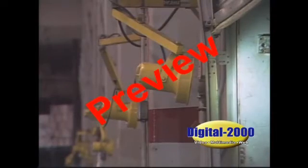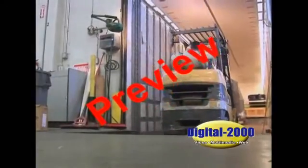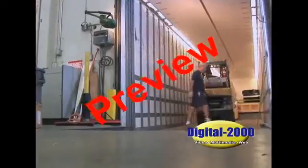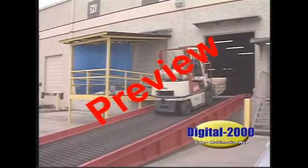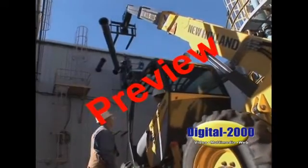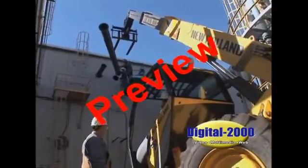Make sure you have adequate lighting to see where you're going. Make sure the truck or trailer floor is safe to drive your forklift inside. When driving up or down a ramp, always keep the load upgrade with the load cradled against the mast. The rule on ramps is simple: drive up, back down. You're beginning to see how simple these rules are and how easy it is to become a safe and efficient forklift operator.